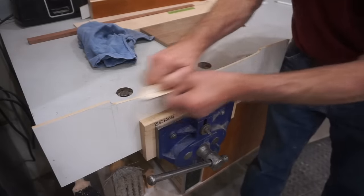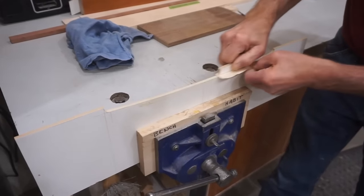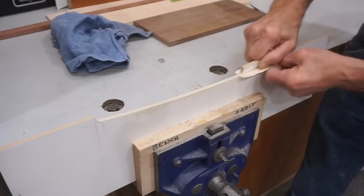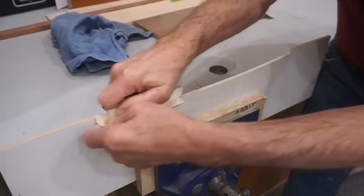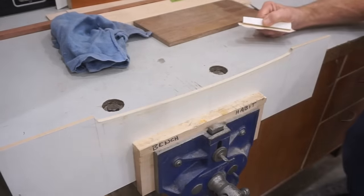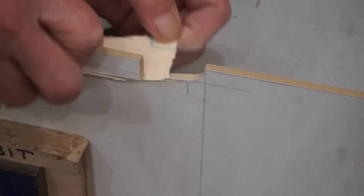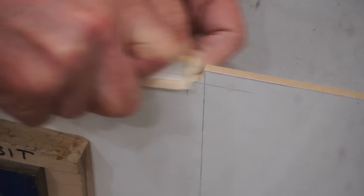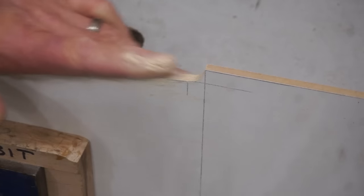And I finish up with a few licks using 80 grit sandpaper on the custom curved sanding block I just made at the bandsaw to quickly fine-tune the sweeping arc of this curve. The trickiest part is the tangent point between the little arc on the end and the sweeping arc in the middle. So pay a little extra attention there if necessary, so there's not a little difficulty in what should be a smooth transition from one arc to the other.